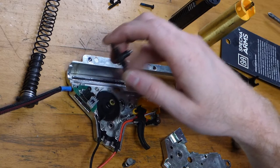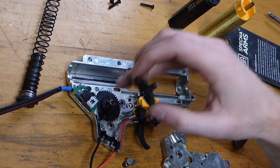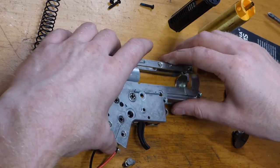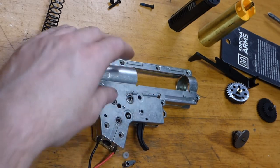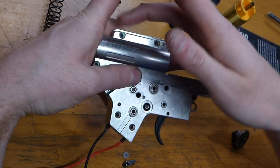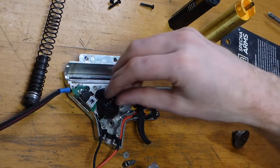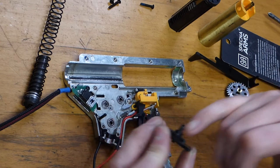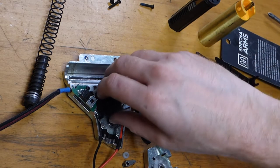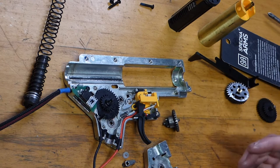It's a little bit proprietary to them, but is it going to affect what we want to achieve at the end of the day? Possibly not, because we can just put a faster motor on it. The decision is to stick with the original gear set rather than try to make it go super fast. Putting the original gears back, they close nicely and are actually shimmed in there quite well. We'll keep the original gear set, make sure everything's shimmed in and aligning with the motor, because we will still put the faster motor in.